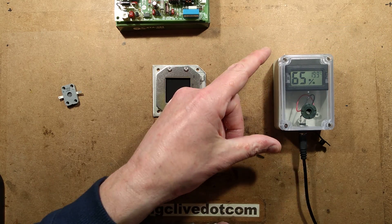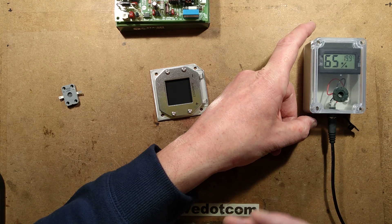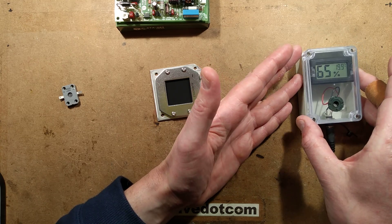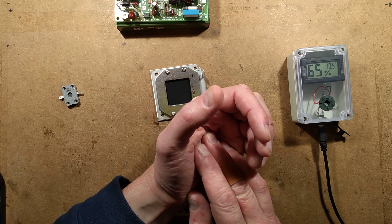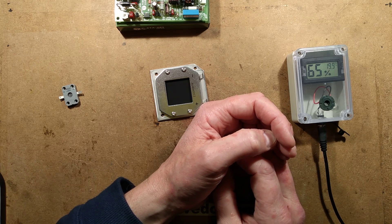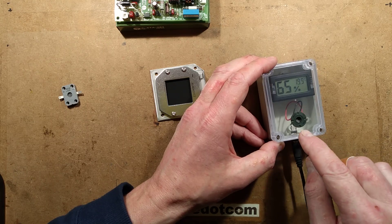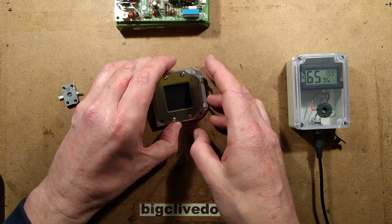You can see this is already sinking down in humidity, and the current is going down as well — still 3 volts applied. My bench power supply says 29mA now. I did a test earlier — I stopped and reloaded it by going outside, opening it up, and letting it re-humidify with ambient outside air as a real-life example. The current had dropped to about 19mA, and if you consider 3 volts at 19mA, that's the equivalent power of an LED. And the humidity at that point was down to 38%. That is a dramatic effect. Keep in mind this is just a tiny little plug with about 6mm diameter of exposed area — roughly a quarter of an inch disc. And they do much larger versions, including panels of these, for large electrical cabinets with volumes of a few cubic metres.